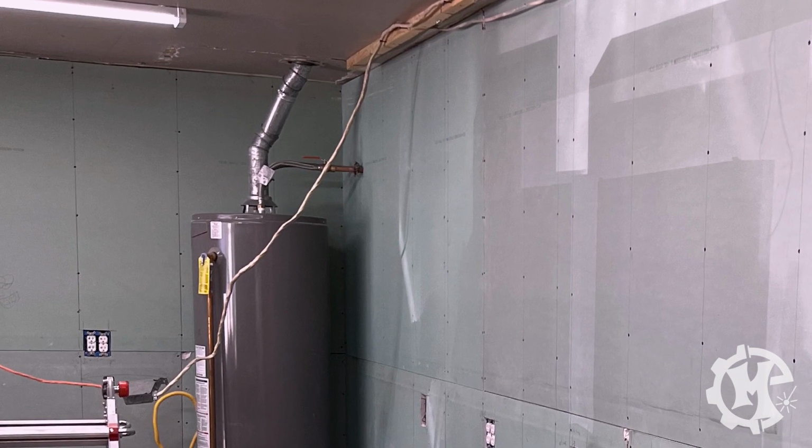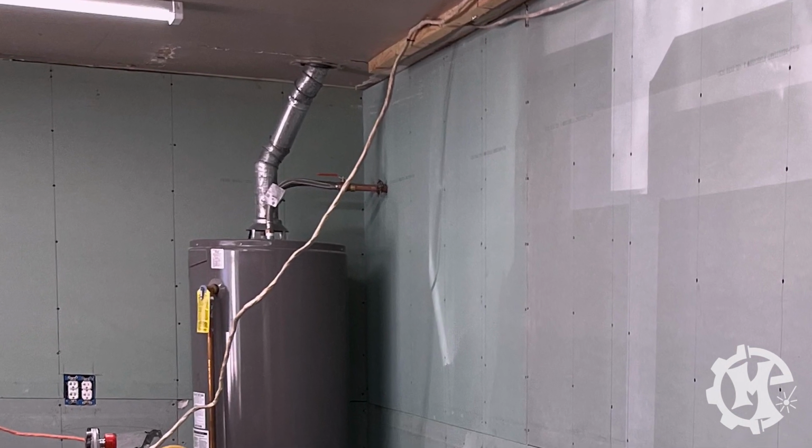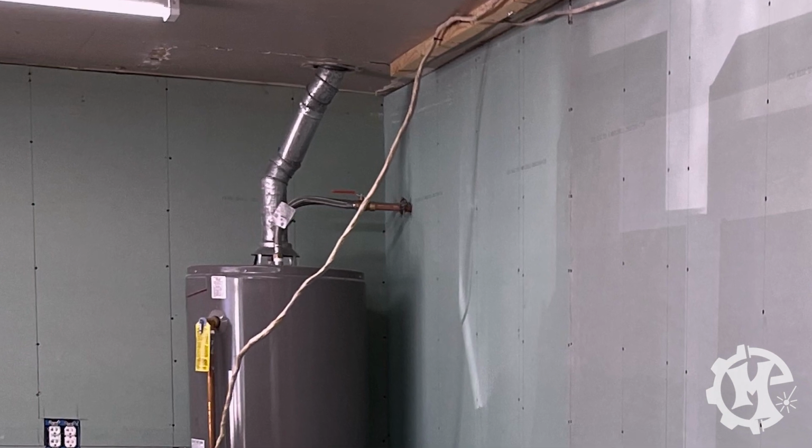And then when we were at the water heater, we found out that they didn't plumb the exhaust of the water heater up properly. So instead of connecting it to the piping and tubing the way it should have been done, they just had it pumping into the floor in between the 2 levels of our house. So it could have caused a major fire. We caught that, we fixed it, that's good to go now. So we had some adventures along the way. Oh, I forgot to mention, we had boards that were molded out from a water leak that was hidden. I don't know that it was hidden maliciously, but it was hidden behind cabinets. We had to replace studs in that wall.